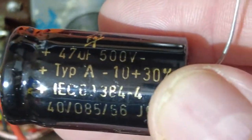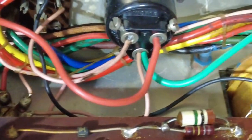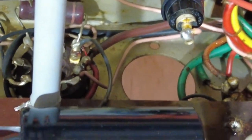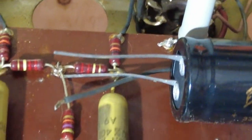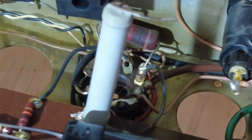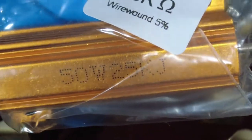We've got four of those and each pair goes in series — that's how these work. Then going on down the line we've got more capacitors to fit, bias to sort out, one or two plate resistors, bits and bobs. And then this big resistor which we're moving off this board and onto the chassis — a 50-watt 25k resistor, 25,000 ohms.